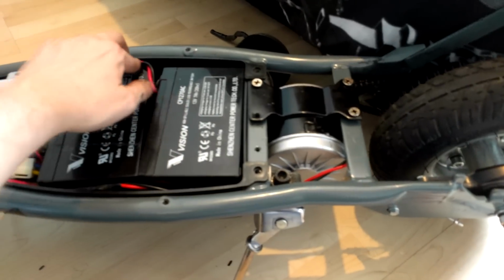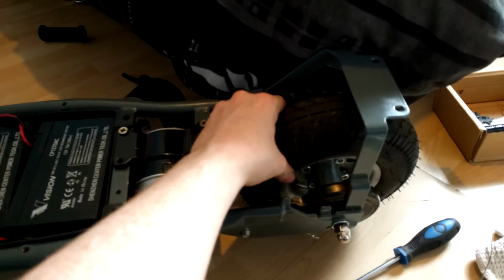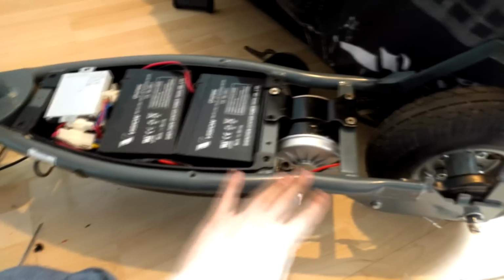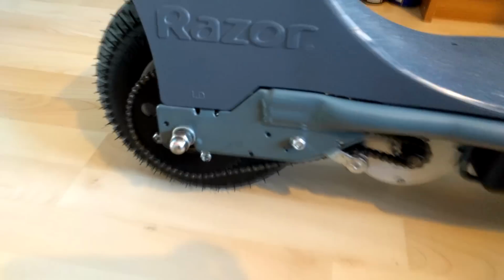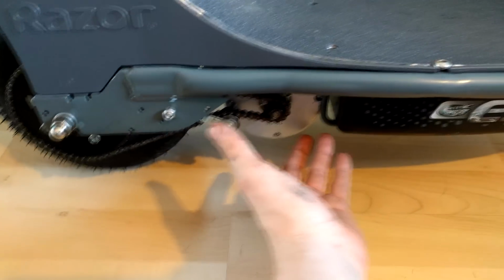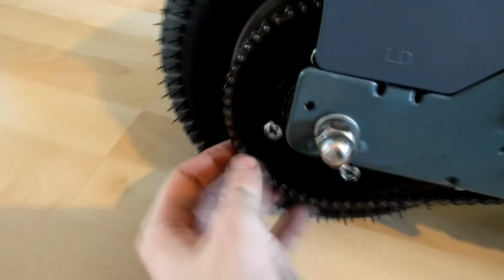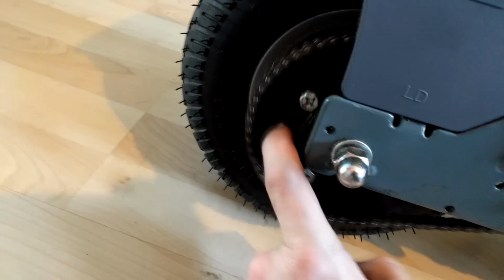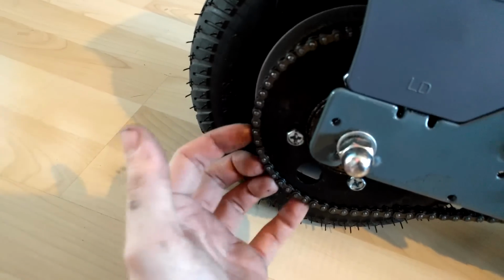The next video you'll see is me with it all complete together, turned on, accelerating, seeing how it pulls. I'm actually quite happy with how well this has gone together so far. Thumbs up. As you can see, I've put it back together. I left the chain guard off because I just like the look of an exposed chain. I might change the rear sprocket too. I can't remember how many teeth this is, I think it's like 54 teeth or something. I'm gonna change it to give it bigger teeth, so that way it's got more oomph when pulling away. And then this is pretty much it.